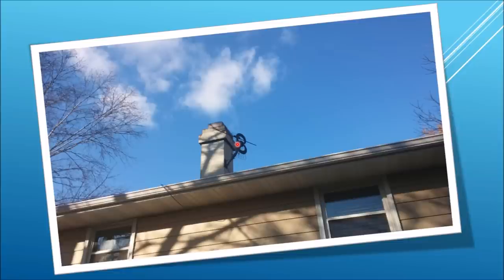Now, this used to not be a problem with analog TV. You might get a little bit of ghosting and a little bit of fuzziness here and there, but for the most part, you can still easily see the picture. Well, with digital broadcast nowadays, multipath is just the devil when it comes to digital tuners. They're very sensitive to it. Some tuners are better than others at filtering it out. But essentially, if the tuner sees too much interference and cannot replicate those packets properly, it's just going to say, I can't do it, and it's going to drop the signal entirely. If it can't get through the errors, it's just going to drop.